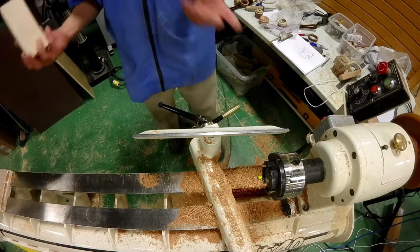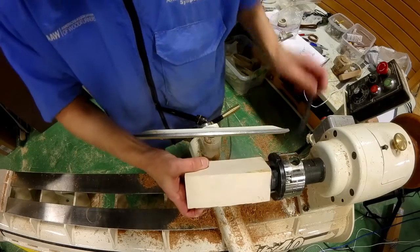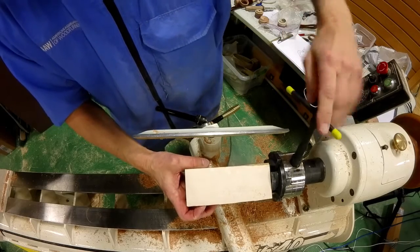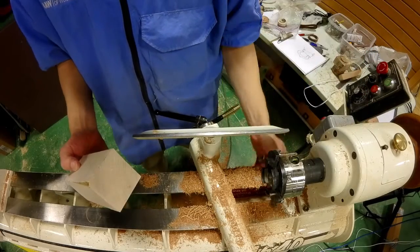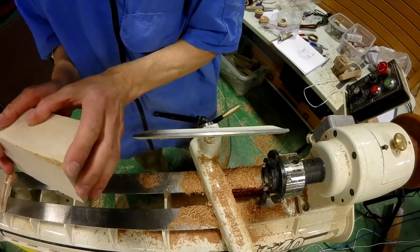So again, if you have a very precious piece of wood, which sometimes you might, see whether that goes into that chuck. Probably not. If you have a very precious piece of wood and it's not much, you can use the trick I used this morning of putting glue blocks on both sides, right? So then you use less of the wood.